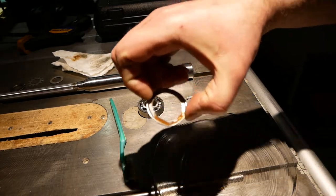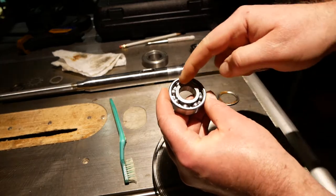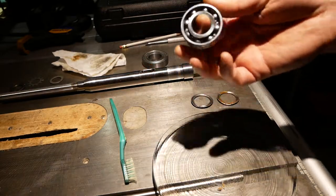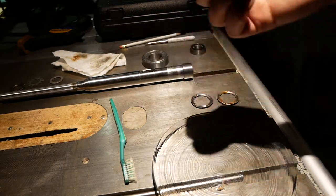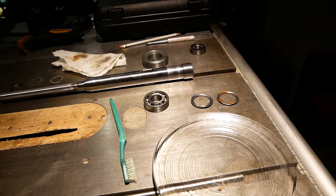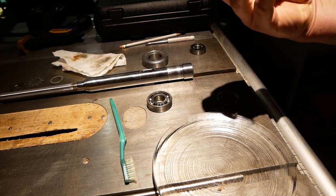Now it's completely dry inside and there are still crunchies in there. Looking at the actual shields, this side has a little bit of grease on it and this side has none at all — same inside the bearing. One side of the cage had grease and the other side was pretty dry, though the balls themselves were lubricated. It was simply that the bearing didn't get fully packed with grease. The only way this bearing would be crunchy with no metal when washed out — other than that tiny speck — is if this thing was bad straight from the factory. Just a miss from their QA people.